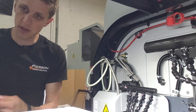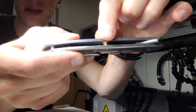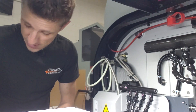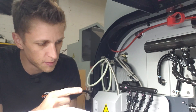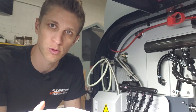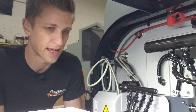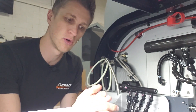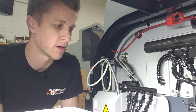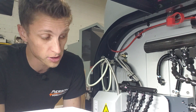That is the part that goes right back in here. My personal one has multicolored variations because why not. I've got a piece of brass in there right now. I'm touching off all the tools. There's no touch probes or anything on this lathe so you have to manually do it with a shim — move it in until the shim doesn't move and then you know your tool is that far away from the material.